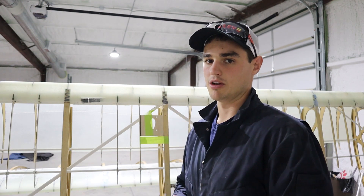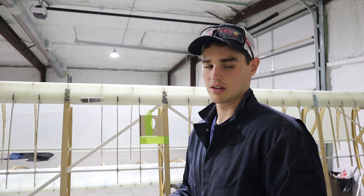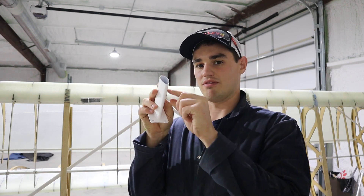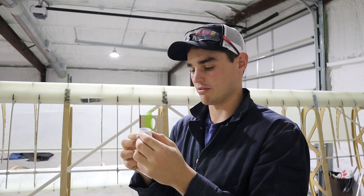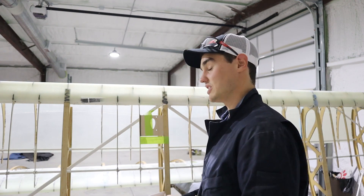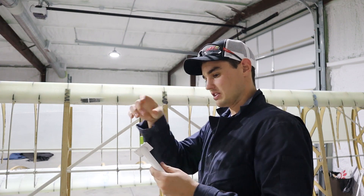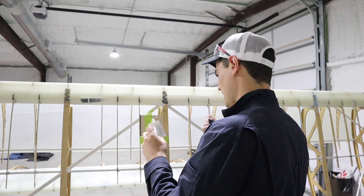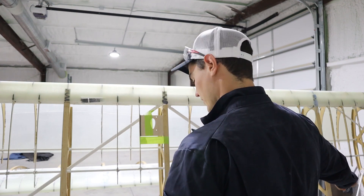I mounted my pitot mount plate. I opted for the Garmin pitot tube option — you can get it from Kitfox. I should have just bought all this stuff from Aircraft Spruce; I was just a little bit intimidated and didn't know what I needed. If I had to buy it from Aircraft Spruce, I'd buy one of these that works with the Garmin pitot tube — they'll have the holes pre-drilled. The pitot tube actually gets screwed in at the bottom, so I'm going to have to line those holes up and drill them myself. I got this plate mounted in, which is the same as the plate they provide in the kit. They send you another one and a little bit more plumbing because the Garmin pitot tube is also an AOA, so there's pitot and AOA plumbing. Once I get the pitot tube in, I'll fit the aluminum. I think I need a flaring tool to flare the end of the tubes, then put the plumbing in and run little Tygon tubing — little air lines — all the way to the rear spar on the outboard end.